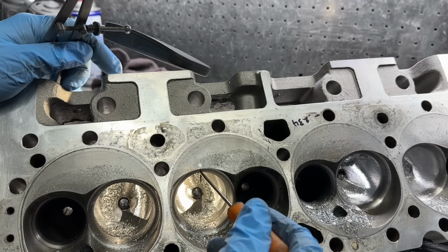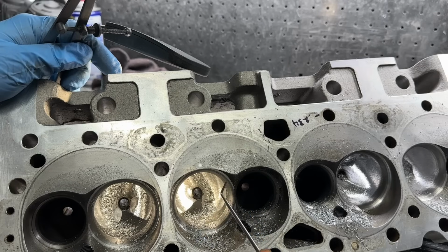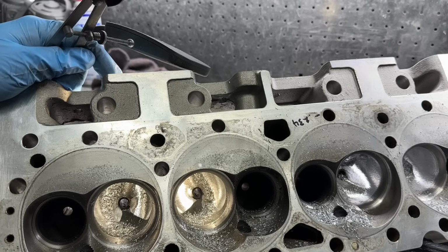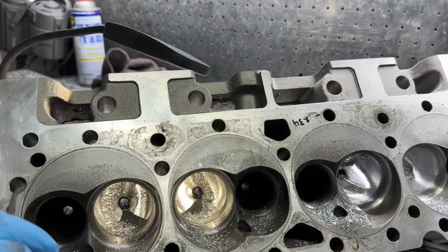Now you might say, what about top and bottom? Well, I don't touch this part of the throat on the short side until I'm actually working the short side. This bottom part, pretty much from here to here, I'm working with what I'm doing right here when I'm in this position. I won't touch the actual short side throat area until I'm doing the short side, which is way down the line as far as porting goes.